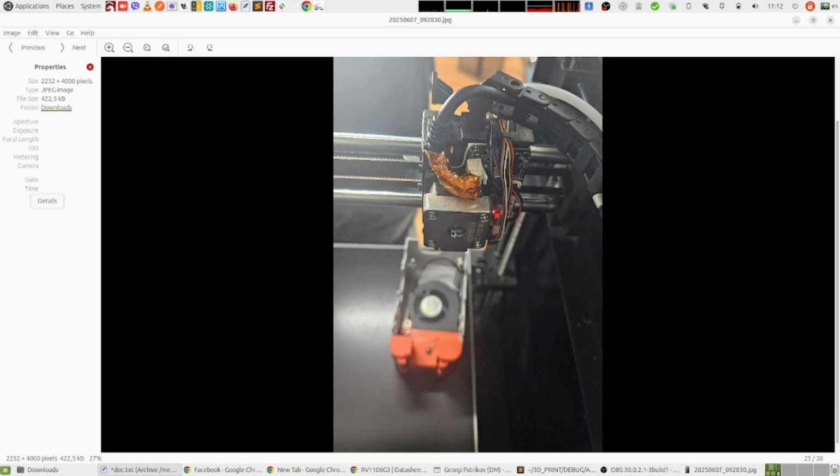Okay, so to sum it up for this printer, in these 4 parts of the series, in the first part, I solved the issue that I had with the pressure sensor. And I have to say that this type of pressure sensor is very unlikely to become faulty because it's just a metal piece that is calibrated and it's very strong metal. And unless you break the wires that are going to the metal piece, or you apply a huge force on the metal and bend it out somehow, there is almost no other way for these sensors to become faulty.